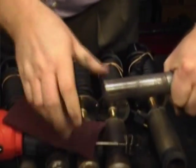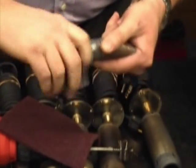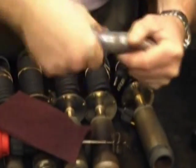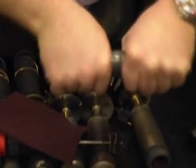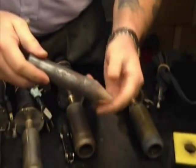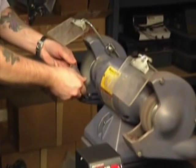In some instances, if you've let it go like this one for a long period, you may have to get some emery cloth and go in there and clean it with that. Within limitations, this will do an adequate job of removing some of the material. When you still don't get enough of it off, you're probably going to have to take a wire wheel on a standard bench grinder and clean it off that way. You can see how much buildup was actually on that tip — it's very important to remove that buildup in order to maintain good thermal transfer.